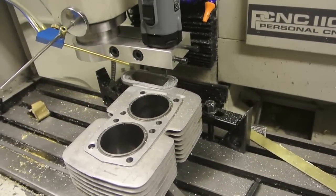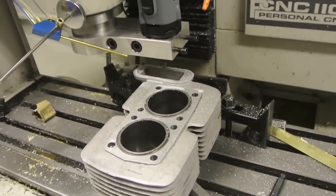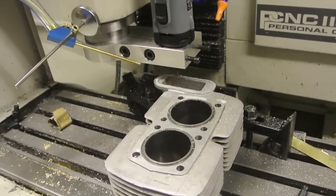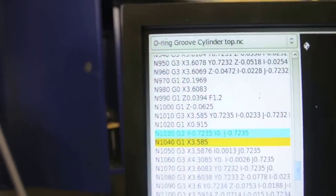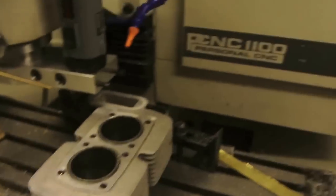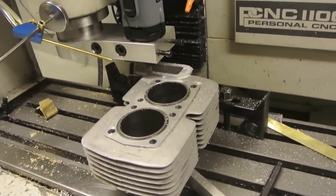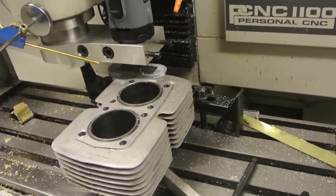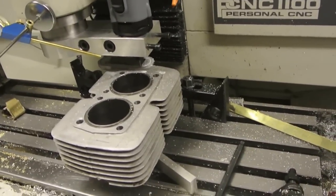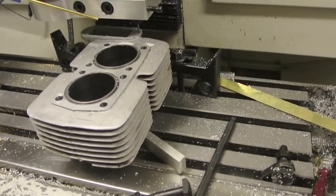This could be the last cut — there's very little cut on there, only 0.1 of a mill. And if you look on here it says Z minus 0.0625, which is exactly where I wanted it. That was really clean for that little program — didn't take long to do. Fortunately I realised I wasn't going to make a mistake and corrected things, and it was easily corrected. The nice thing about that is being able to dive in there and sort things out fairly quickly.